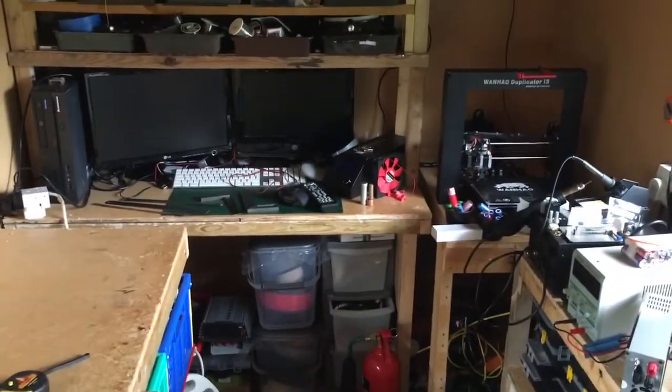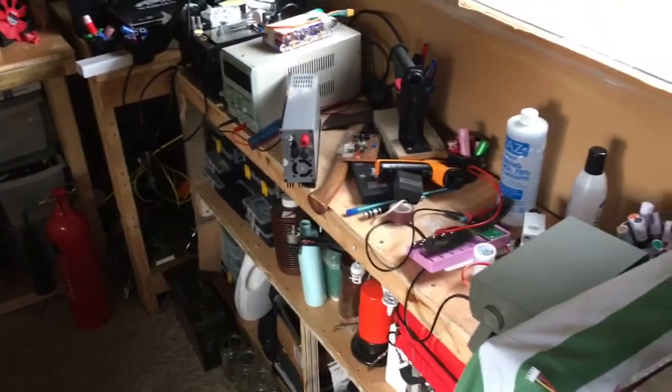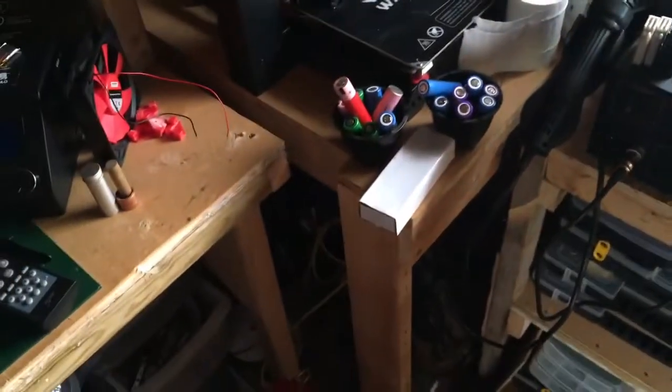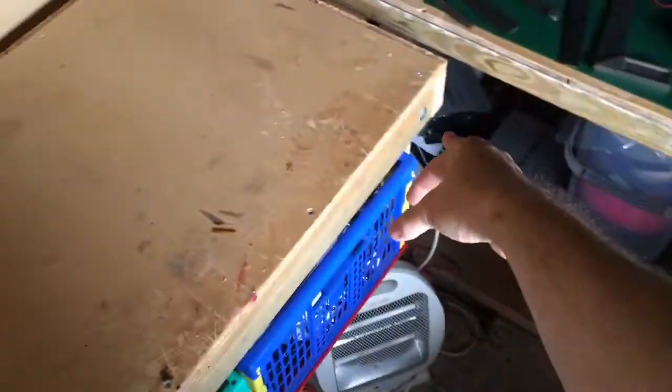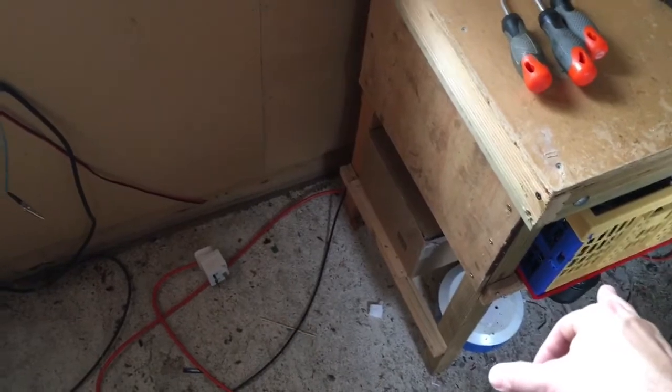The solar array is unhooked at the moment, so no solar today. I'm going to be widening the benches in here — making them a bit deeper — and also get rid of that shelving unit I made out of scrap. I'm going to lay sheets across the tops of these three benches and bring them out about an extra 15 centimeters, in line with the edge of this bench, right across here. I'll bring this side out 15 centimeters as well, then angle it so it meets up at the door — otherwise it will be sticking way out.